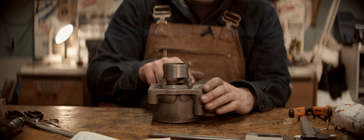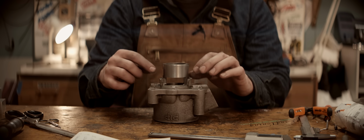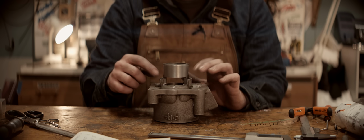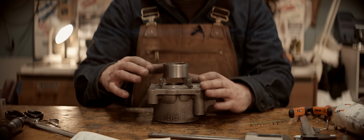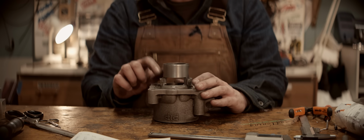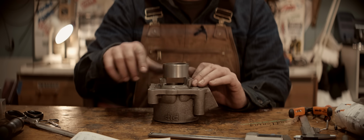But it doesn't matter, because the liner is so thick, so there's no need for the support from this, and they're not really needed to align the cylinder onto the case either, so no problem. I'll just break them off and grind to make them smooth.